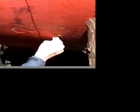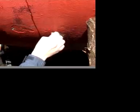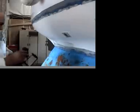Osmosis is the curse of a modern fiberglass yacht, and the one behind me has a particularly bad case. Scrape away the antifoul, and you can see the problem. Polyester gel coat has allowed moisture through to react with pockets of styrene in the layer. It's difficult to show the blisters, but then if you pop one... It's good stuff easing out here.